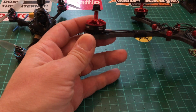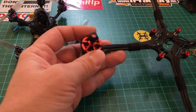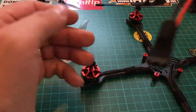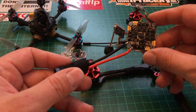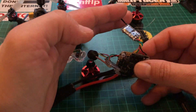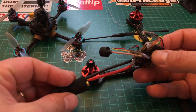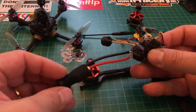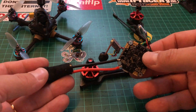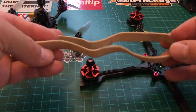For the motors I got some XNova 1804 at 3100 KV, which is the lowest KV available for this one. I'll come back to motors a bit later. The Beta FPV board, which you can see, is the same as the 12-amp version. I've paired it with the Ichi Nano VTX and the Crossfire Nano receiver. I swapped the connector for an XT60 with a capacitor — a 4S capacitor I use on my classic 4S freestyle builds. And that's about it, because it's still like a whoopie build: very few components that you put together and just send it.